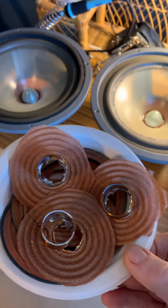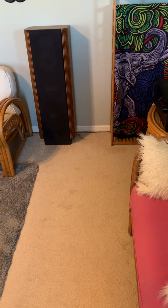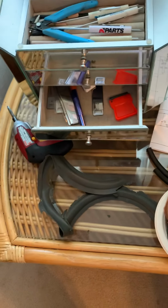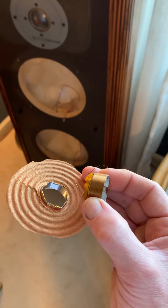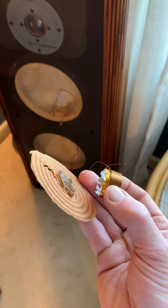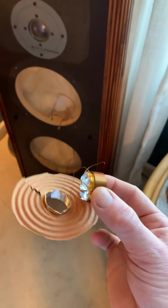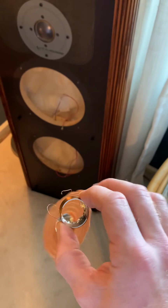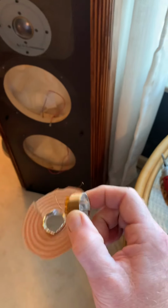These were voice coils I had to pull off of a similar speaker, which is the RS-IIIB. These, again, I got them at a great price, but when I got them, I knew something was wrong, at least on one of these, and I figured I could fix it. But in this case, I had to fix them all. You can find speakers and think they're all good and you can fix them. It's just a foam, but in some cases, the previous owner of this set of speakers really played them with the foams gone, and the voice coil just disintegrated. And you can see it's very, very fragile, very thin, and when this thing starts rubbing on that post, it's going to go. So a lot more work here compared to a refoam.